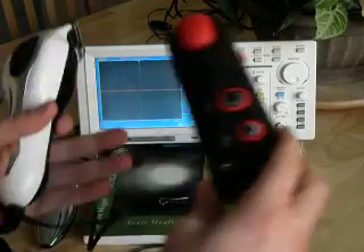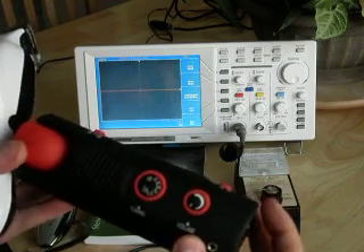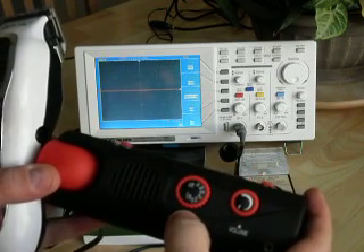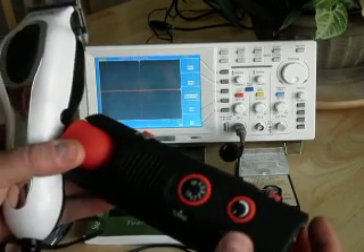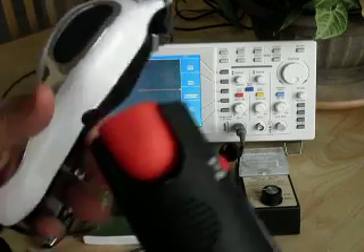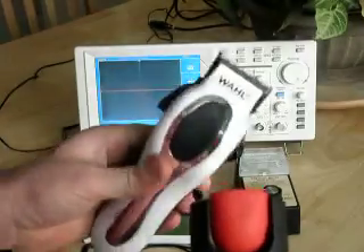That is verified with this particular trimmer by using an AM radio, which tends to be a little bit more sensitive than the tri-field. We're tuned into AM 530 because there are no radio stations on AM 530 — what we're looking for is wideband radio emissions. As long as you're tuned into static anywhere on the AM band where there's no radio station, it should work. So the mains powered trimmers don't actually produce any radio waves that we can detect.